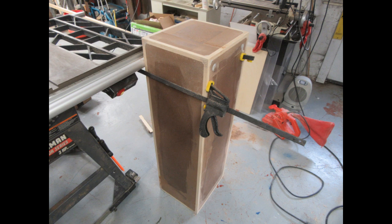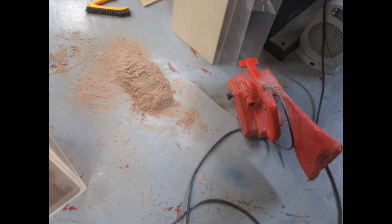I normally just lay the case on the floor to do the big sides, but for the ends I use my beam clamps to rest the case on end and clamp it to the table saw for stability. In this photo you can see I have touched the masonite in some areas with the belt sander — I try not to do that, but it's awfully hard and if you touch it ever so slightly it looks different. A fair amount of sawdust is made from the sander. You can see where I've emptied the bag on the floor prior to vacuuming it up with my shop vac.